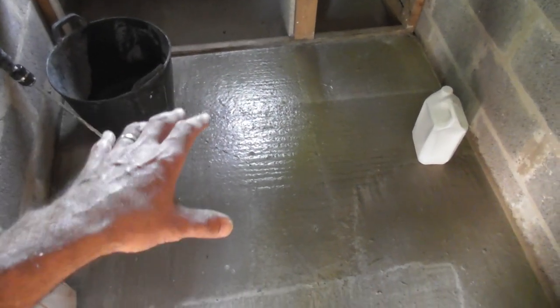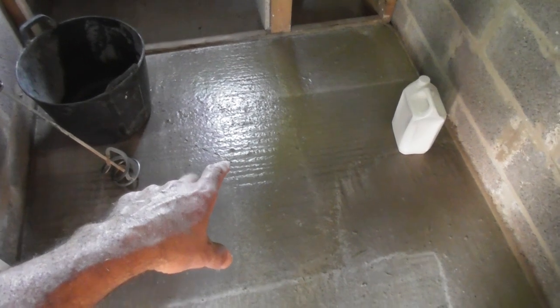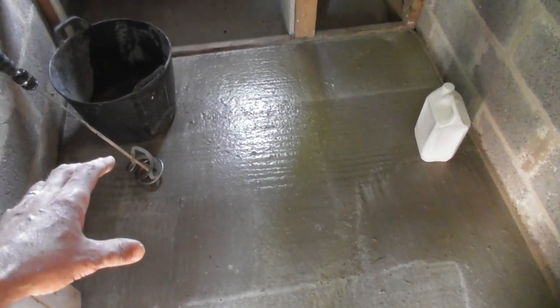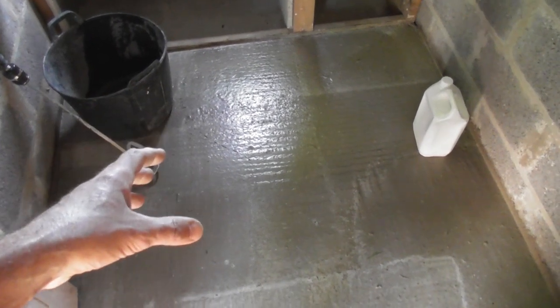Preparation for the floor — what you want is a nice clean floor. In this case I laid the concrete yesterday. You can see it's very shiny at the moment, still a little bit damp probably. I want to get the floor leveller down now because when it's still wet it will tend to bond better than if you let it get dry and dusty.